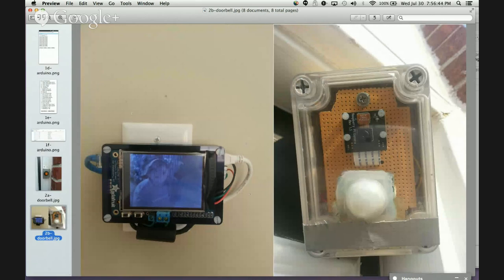And I basically have, on these GPIOs, I wired in a doorbell sensor so I can pick up when somebody rings the doorbell. And then on the outside of the house here is a camera, so whenever they ring the doorbell, this Raspberry Pi takes their picture in the basement, which then looks up what devices are registered for a front doorbell press, and then sends that picture of who's at your door to your Android phone. So those are all the components to it.